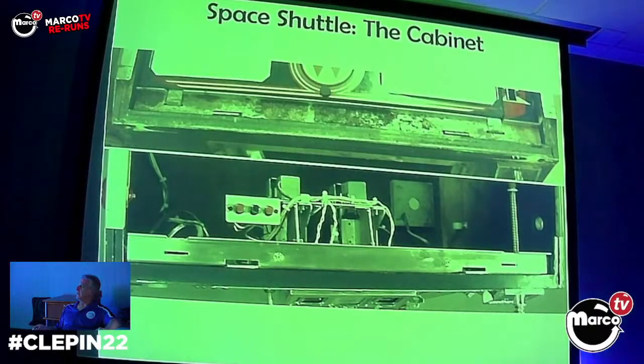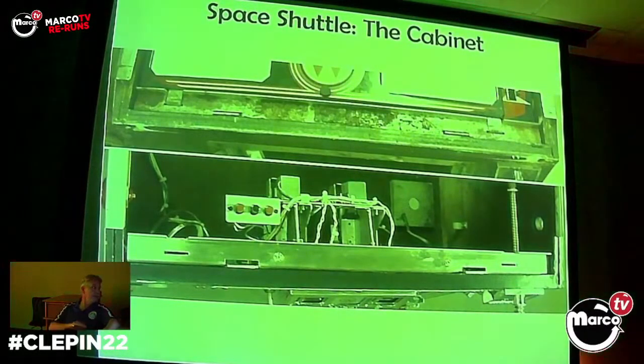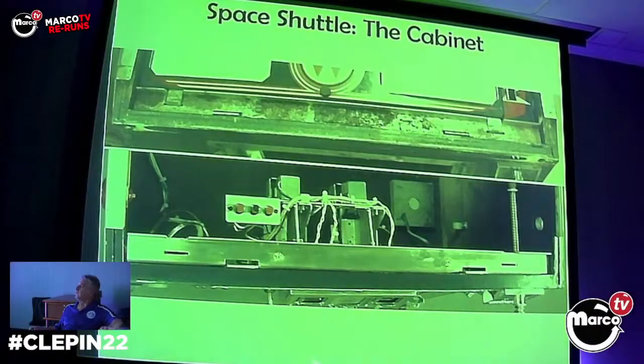And then even those, you go back in on some of this stuff that's really rusted into it. I think I sanded that also. I started with a 100 grit sandpaper, went to like a 250 or 400, and then used the green Scotch-Brite as the final to make it really just smooth as can be. I even polished the little brass.